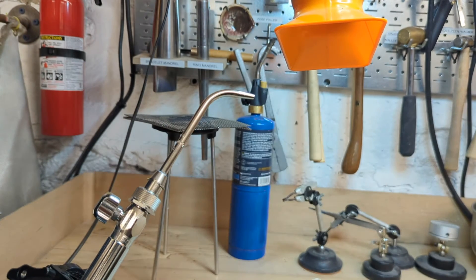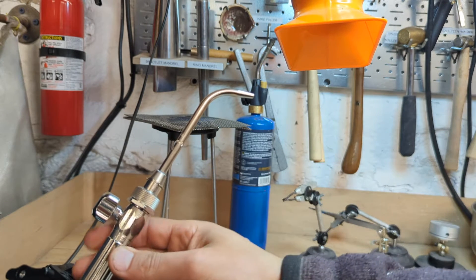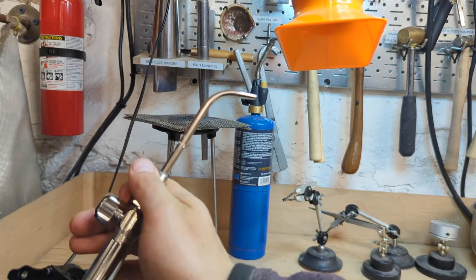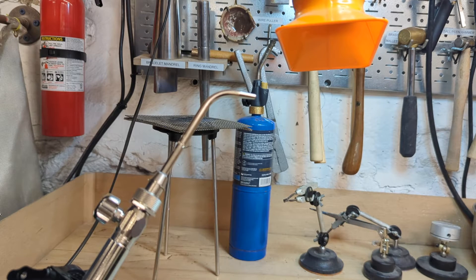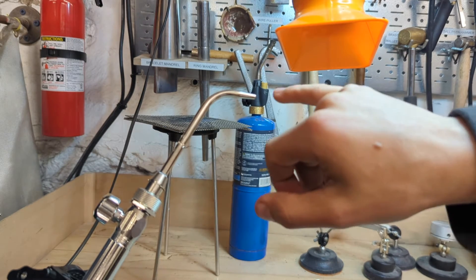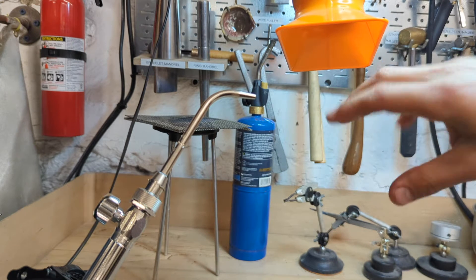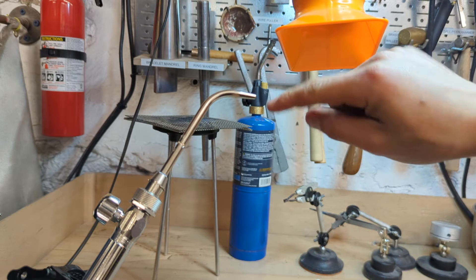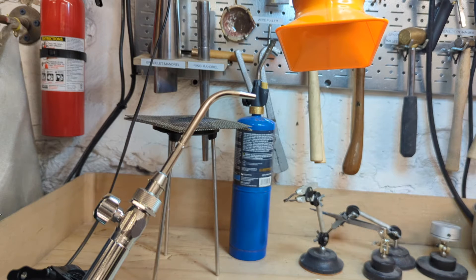Then we can modulate it up or down depending on how big of a flame we want. The air from the room goes in through these little holes on the sides around the edge here. So you don't want your hand covering those because then the air won't be able to get in. And once the torch is lit, the hottest part of the flame is going to be an inner blue cone that you'll be able to see. It's going to shoot a bigger jet of flame, which is obviously very hot, but if you really want to be using the hottest part — which you sometimes don't want — it's going to be that inner blue cone.